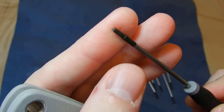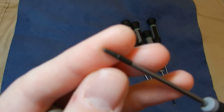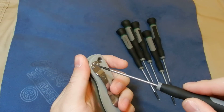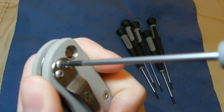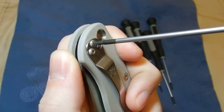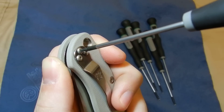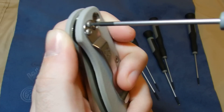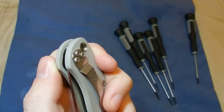The T7 is my most used Torx driver because T6 is the most common size I deal with. The T7 head from this Ace Hardware precision set is absolutely perfect for T6 bolts. The first time you use a T7 on a T6 screw, you may have to drive it in really hard to get that coating off, but after that — there's absolutely zero play. I'm twisting back and forth and it's completely snug. Compare that to the T6 in a T6 bolt which wiggles noticeably.